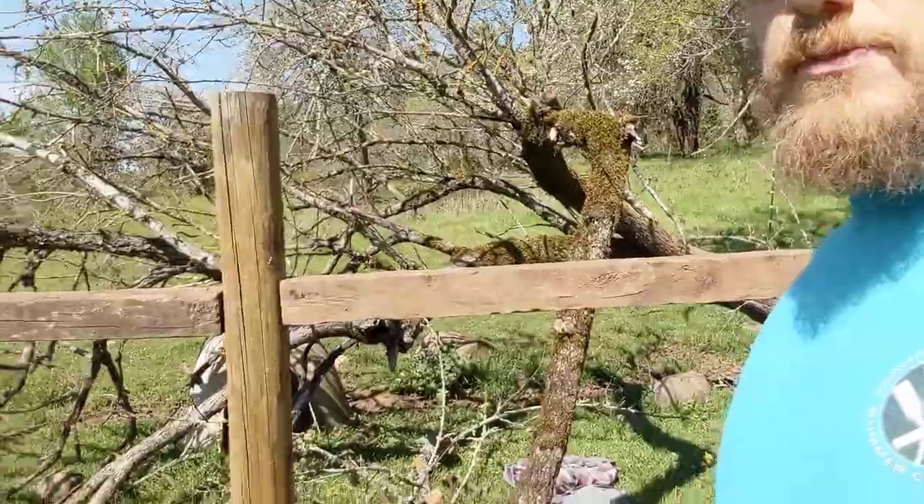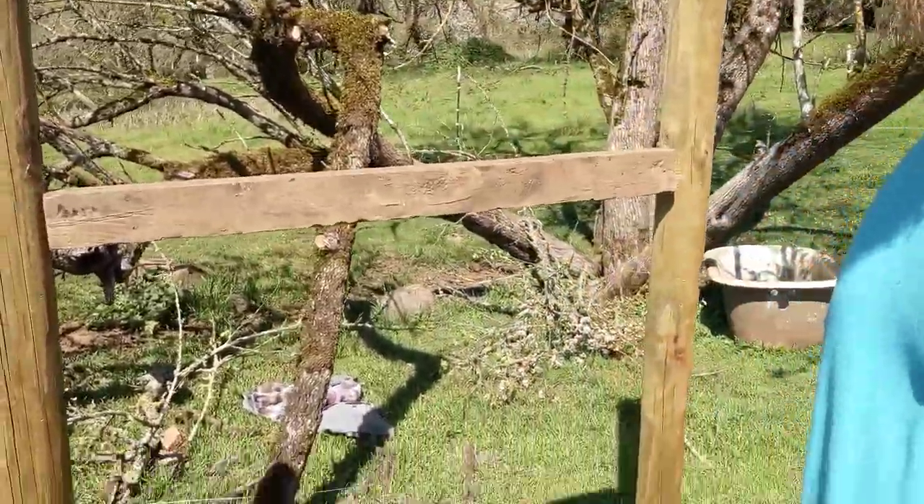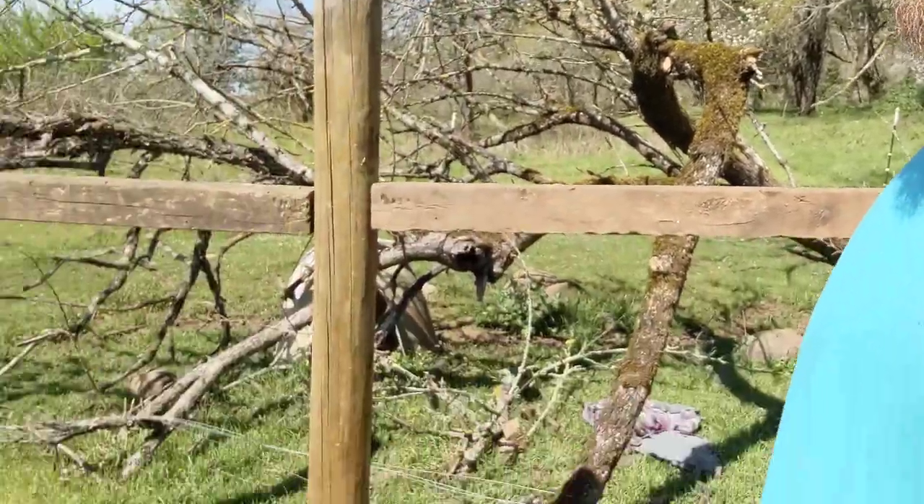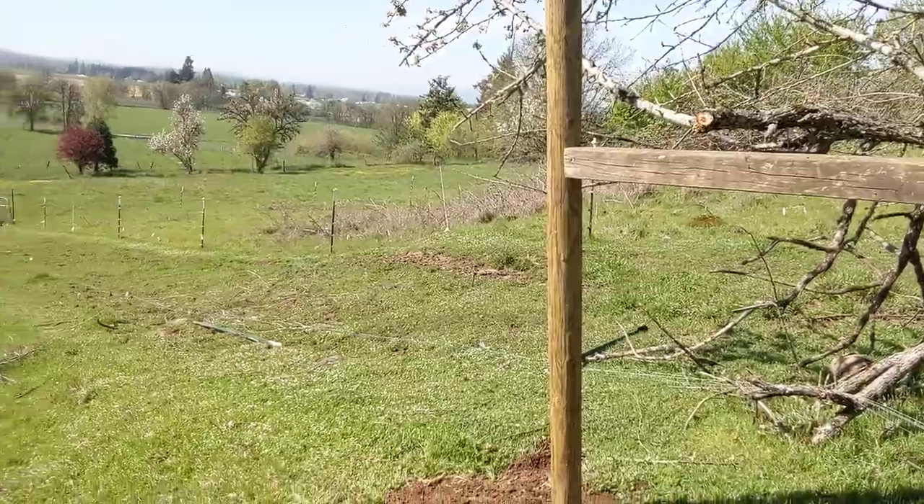Things in common between woven and other fence solutions: how you build your corners or ends — that's important. You can see behind me here I've got three posts with bracers. This is a slight angle in the fence line — maybe 10 to 15 degrees — but it's enough that I wouldn't want to rely on metal T-posts to hold a tight fence. Plus this gives something to hold up the line. Right here there's a sharp slope headed down the hill, and that turning point is going to create a lot of downward stress on whatever posts are right at that junction.